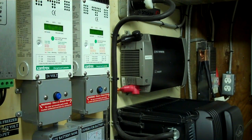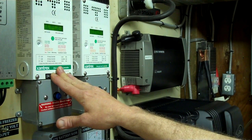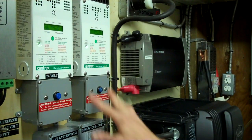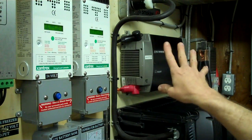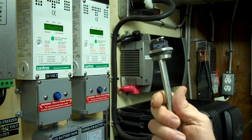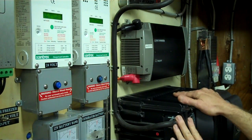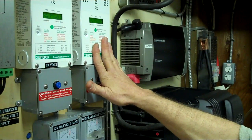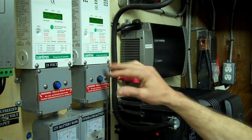For the nuts and bolts of the whole thing: I've had a lot of people ask me why I'm not using modern MPPT charge controllers. The reason is because I wanted to use load controllers to be able to heat water. Of course if the power goes out, it's a great way to use your excess power. What happens with any charge controller when they charge batteries up is they just start to bleed off the voltage and amperage and it's wasted. But if you can send it into a water heater element, that's the way to go. I've got 1200 watts coming into each one of these charge controllers and all they're doing is feeding it right through — it's all being grid tied. If the power were to go out, instead of just bleeding off the excess power, they're going to feed it to the water heater and heat the water.